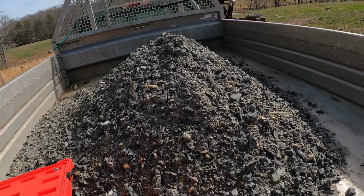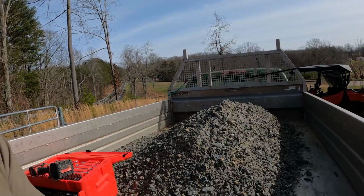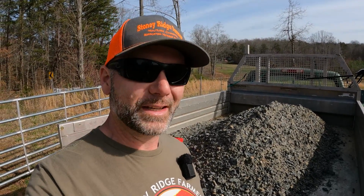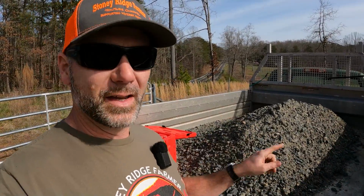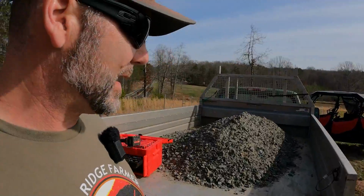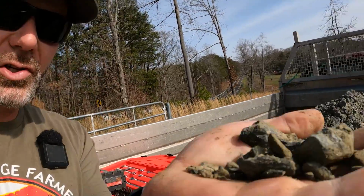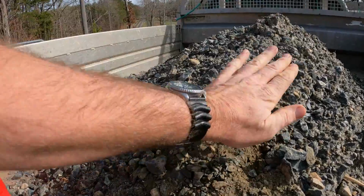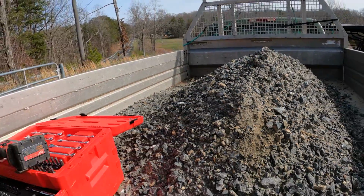As you can tell, we only have about 1 yard of gravel on there. It's probably about 1,400 pounds. That's all this truck wants. We're gonna take it way on the other side of the farm and dump it real quick. Then we're gonna come back and we'll start loading this up. This gravel is called, respectively, around here, Crusher Run, okay? Road-based gravel or Crusher Run. It packs really, really hard, and that's what's gonna solve the problem around the cattle waterer.